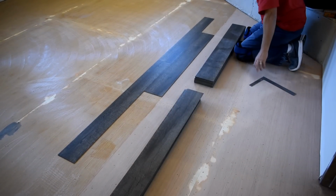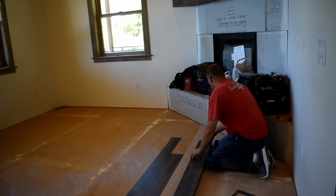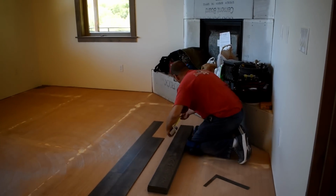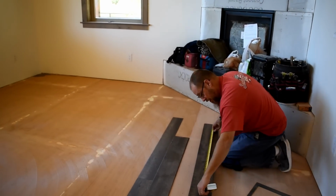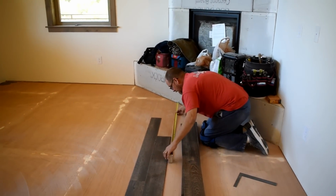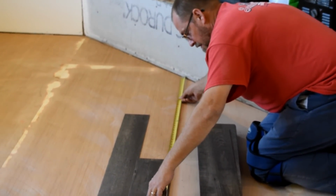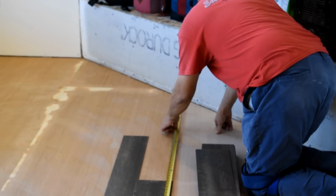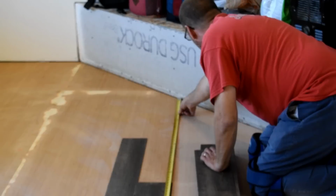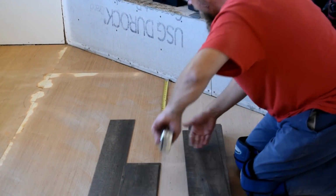This way that I'm fixing to show you how to do this will work on any angle, whether it's a true 45 or whatever it is, it'll work. So I'm going to measure from my point, which is going to be my furthest point. I got a little bit of play because they're going to put stone on this fireplace, but I'm going to follow my chalk line down, and there I'm going to allow myself about 1/8 of an inch, 39 and a half.